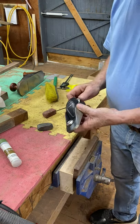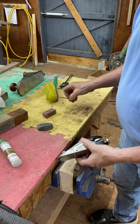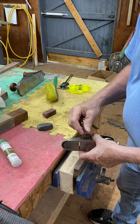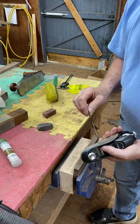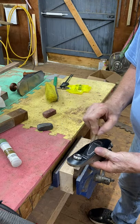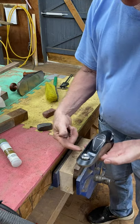What do you do if you have a Veritas plane and you want to adjust the angle? You see these set screws here? These are the screws that virtually nobody who reviews this plane on YouTube mentions. These set screws hold the blade very securely near the cutting edge, side to side.